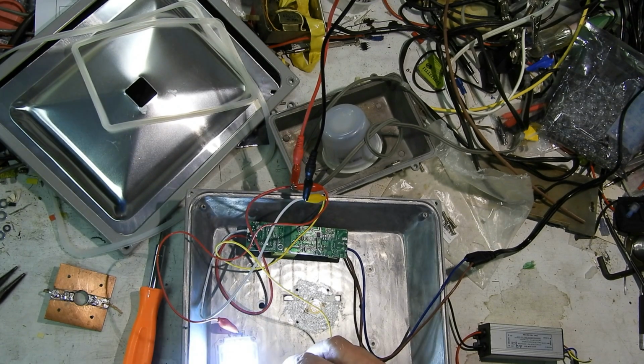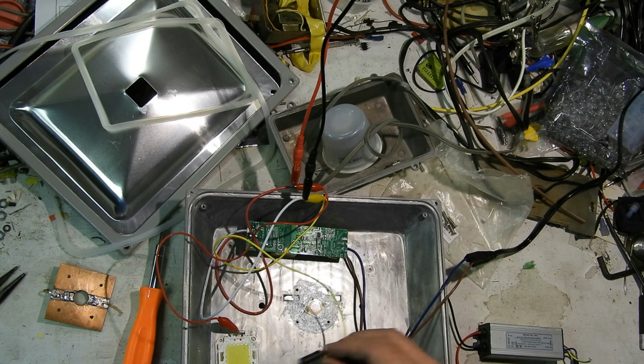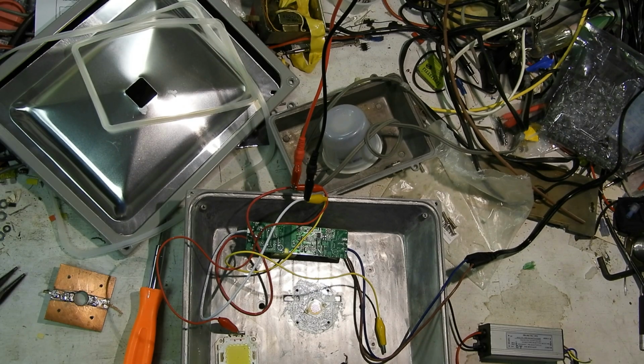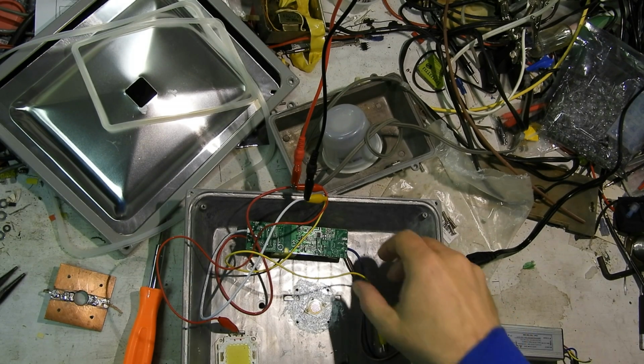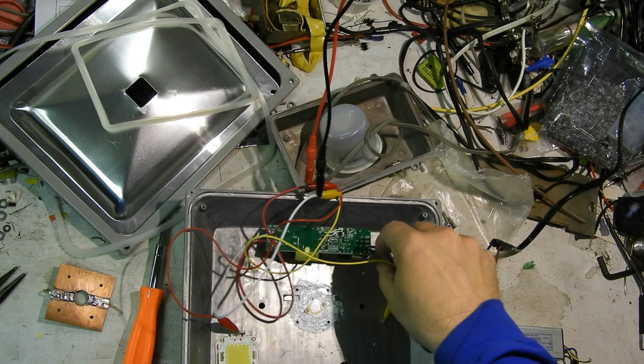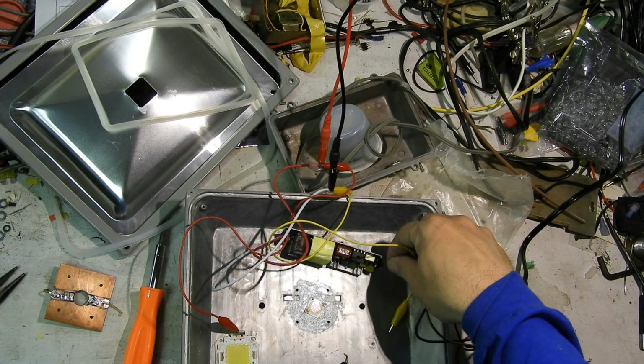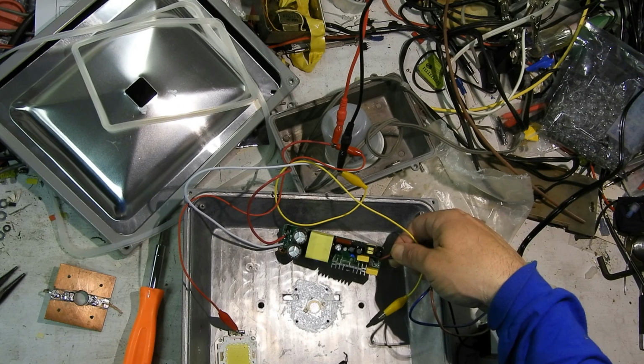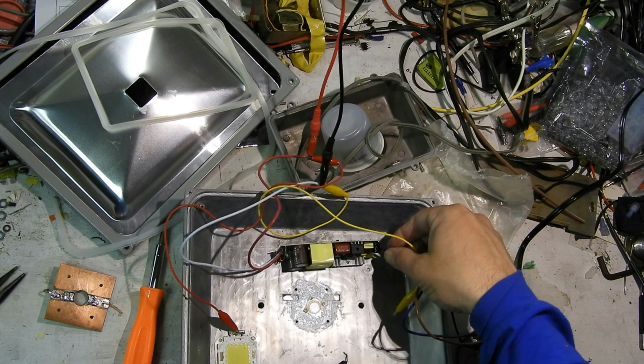Yeah, she's still going to flash. So I can't say it's the chip. It's gotta be my brand new regulator here. So I guess my other problem is beside the point, since I can't get this regulator to really work right. My first problem is, how do I mount this thing? There's no mounting hole, there's no tab hole or anything to mount this with.